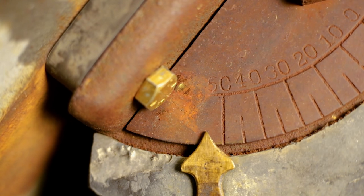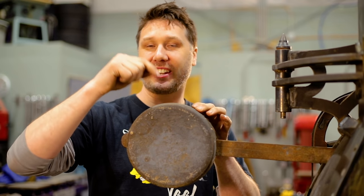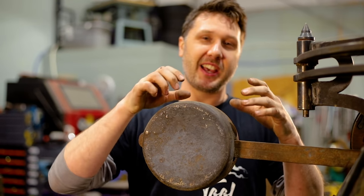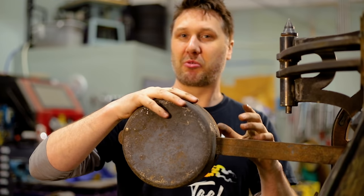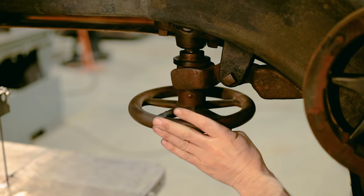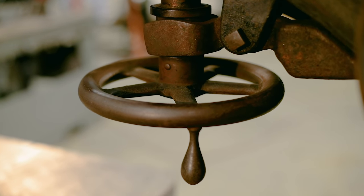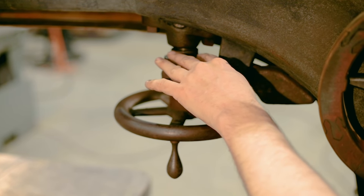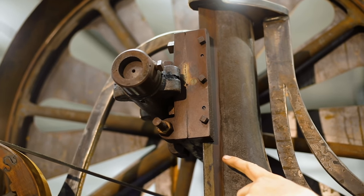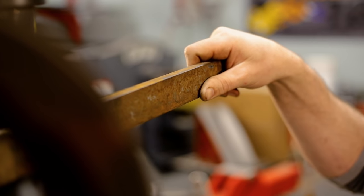What is this big ugly round thing that sticks one foot off the back of the machine? This is the blade tensioner. When you push it in it puts less tension on the blade; you pull it out and lock it down, it puts more tension. This accommodates different widths or thicknesses of blades. The other end of this bar goes to a screw — you adjust the screw to get your correct blade length. Then to set the tension, the screw is floating inside this housing, and the weight keeps it floating so it can balance right in between. If there are any interruptions while cutting, the blade can float and provide perfect tension all the time. It's a clever, simple system with nothing to go wrong, except it adds a lot of length to the overall machine.